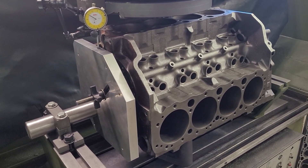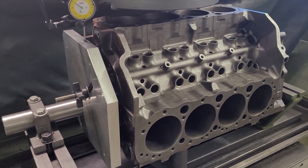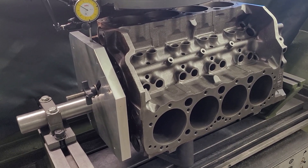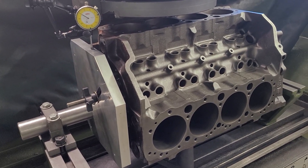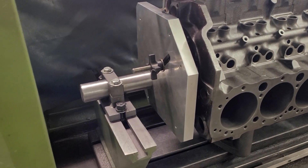The deck surfaces should be 90 degrees to each other but 45 degrees from the crank/cam centerline. What often happens is the factory can bore the cam centerline off its original location, which therefore tends to shift the deck angles off.